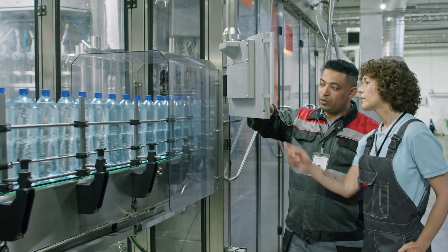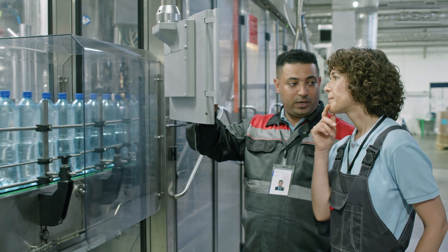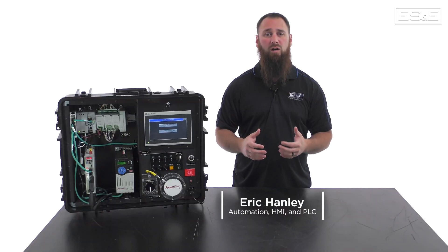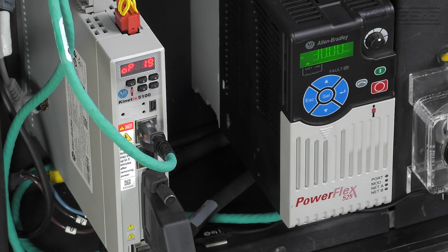Creating a system on a budget can be painful; however, updated functionality from Rockwell has brought about new opportunities that make that happen. In this video, we will cover the hardware and software setup for the Micro 800 controllers to control PointIO, PowerFlex 525 drives, and Kinetix 5100 drives over Ethernet.